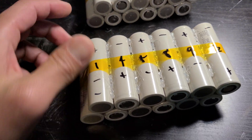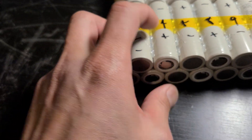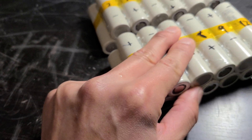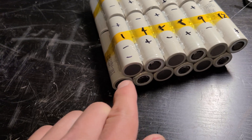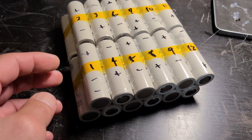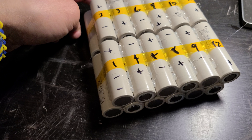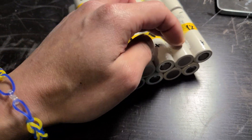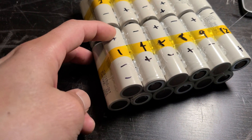This part will only have connections from here to here — just parallel. The difference will be over here where we connect it, and it's gonna look like a rectangle. You really have to imagine where the electricity flow goes. Each pair goes minus to plus, and each of these pairs is 3.6 volts.